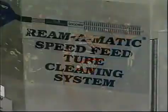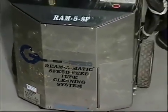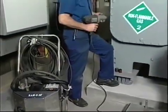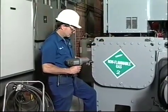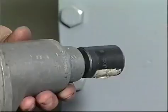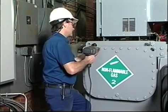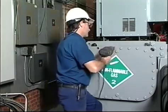The condenser tube should be cleaned and the cooler tube should be cleaned and inspected after the first year of operation. Because the chilled water is a closed circuit, the cooler tubes normally will not need cleaning every year, but the first-year inspection will give the technician a chance to see if the water treatment is adequate and to determine a schedule for future cleaning. The condenser temperature sensors should also be checked for scaling and fouling and cleaned if necessary.